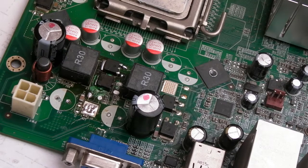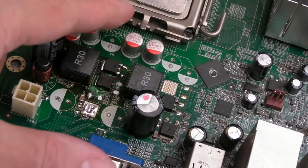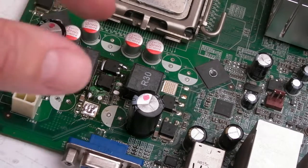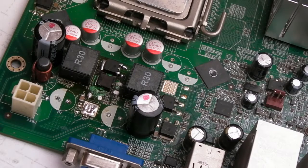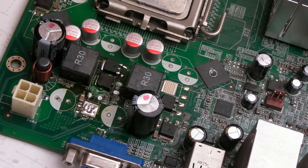So, yeah, it's not cost effective, but it is in the sense that hopefully this will boot and Windows will work and be paired to everything on this board. Well, certainly the CPU, because they have a unique ID, they have a unique key. But maybe in terms of the chipset version and everything as well, I don't know whether that other board at £20 is going to have exactly the same revision of hardware on here. And it might just cause us some issues, but that's nice to know.